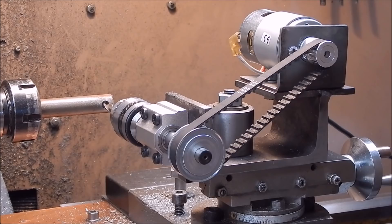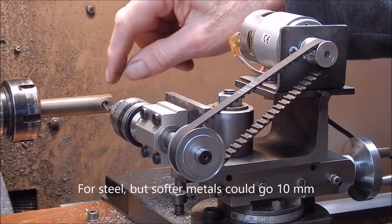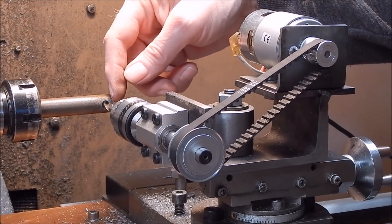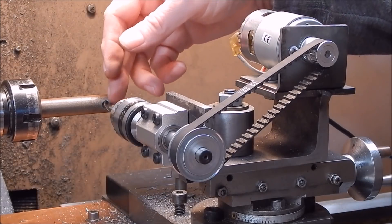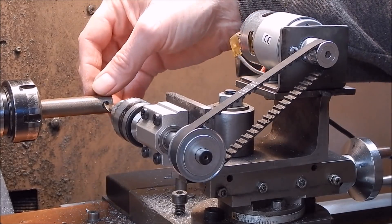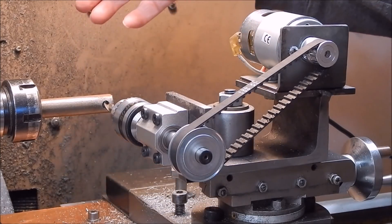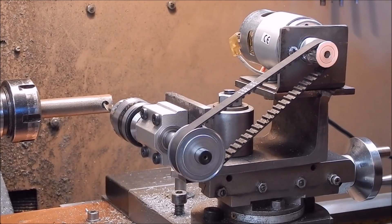That's about it — that's right on the limits. I'd say 5mm maximum; 6mm is too much for trying to drill through on its own into solid steel. As far as opening up holes, if you progressively step through, yeah, it'll do it no problem. I mean, that 6mm went through fine after the previous drill, but when you try to drill through solid steel without having pre-drilled it, 5mm would be it. But once again, drill it with a smaller drill and then just step your way through, and you could go up to 6mm with this no problem at all — but I certainly think that is about the limit.